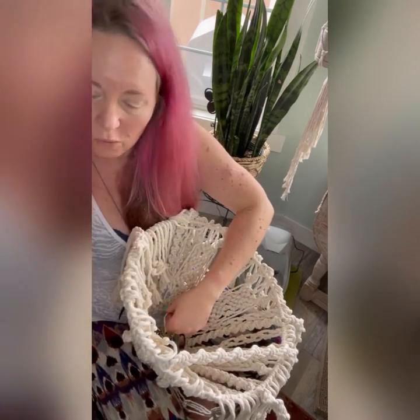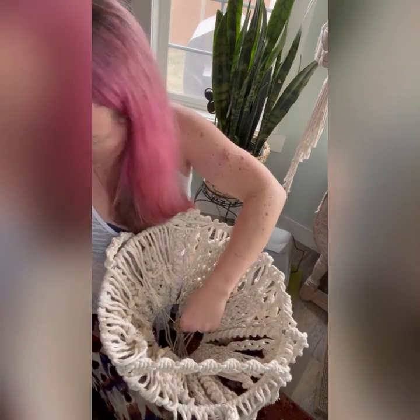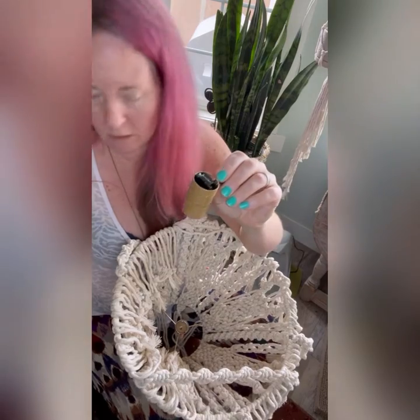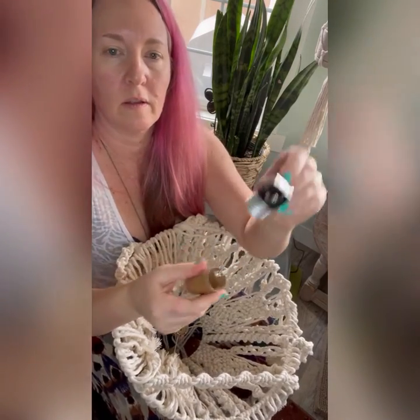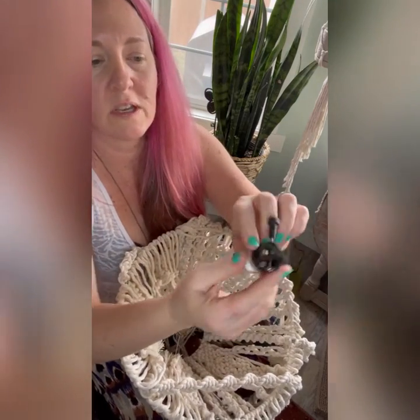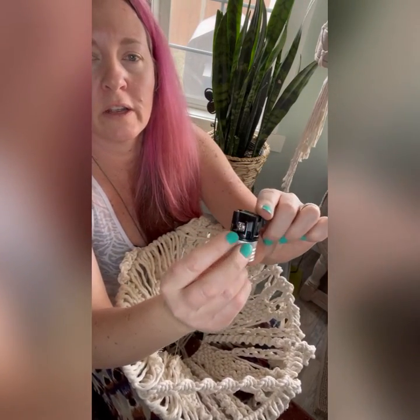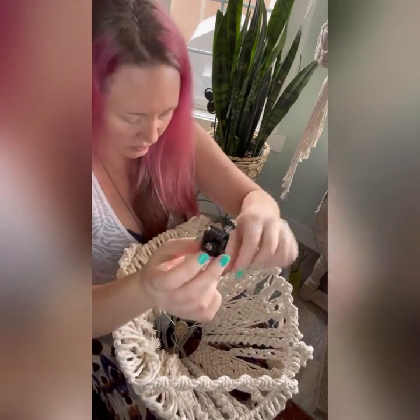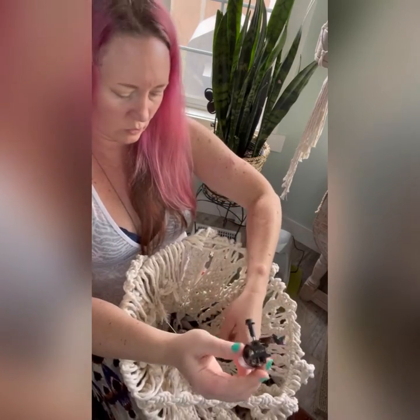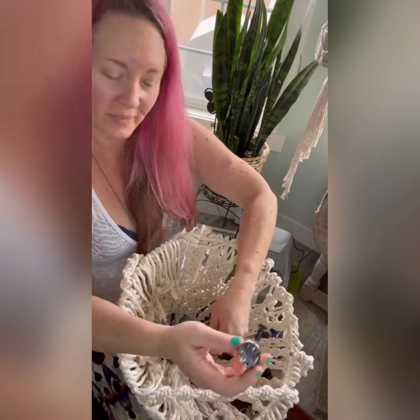You can see that the cord is through there. This is the hard part because you are working inside the lamp to wire this on, and you don't want to make this really long because this part has to snap back in place. So we're gonna wire this in by removing the outer piece and the cardboard. You can see there's a gold screw right here and a silver screw, and it's important that you follow the directions on the wiring kit for what screw goes with which cord.